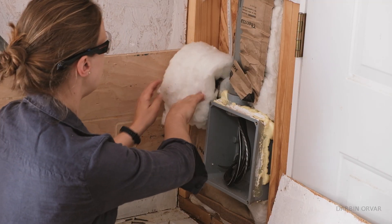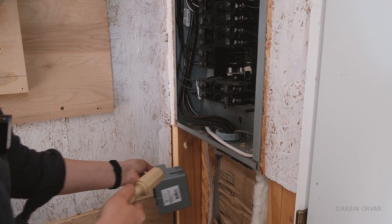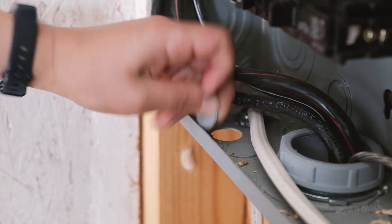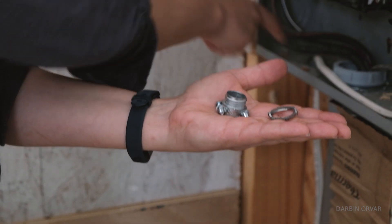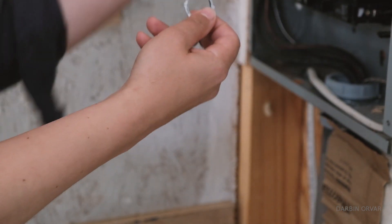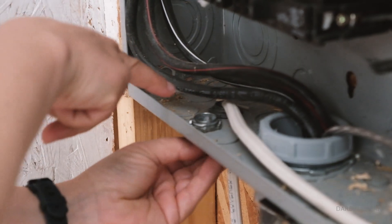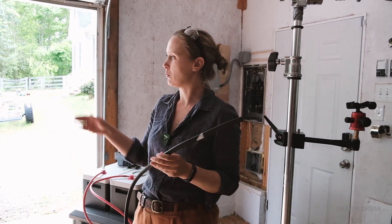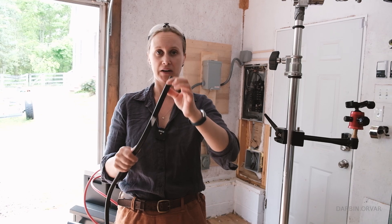First, kind of see where we want to put it. I'm going to place the box right in here, so I need to pop out one of these knockouts so the wire can go through. We've got a hole where I can go through here. Next I'm going to put in this strain relief — make sure the wire isn't going to get yanked out. Put this in from the bottom and screw it in. I'm using 8 gauge wire, which is going to be plenty because I'm only going to be running 24 amps through it, and that's why I'm using a 30 amp breaker.